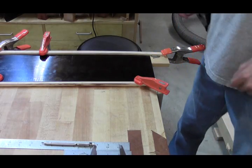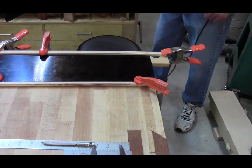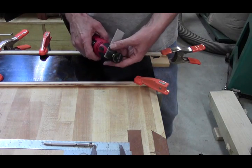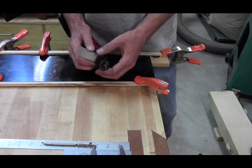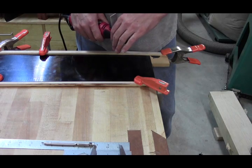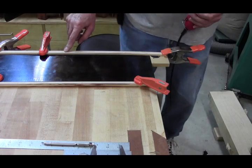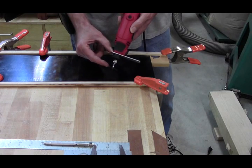I've set up to cut out a blade from my steel. What I'll be using is essentially a generic Dremel tool — I took the collar off of it and slipped a piece of aluminum, just a scrap piece, over that to use as a guide. This worked pretty well the first time I used it so I'm going to stick with it. I don't like to use tin snips to cut this because you put too much stress into it and it's hard to straighten. This way I'll have a nice clean line. I've put down a little strip of plywood as a fence and got it clamped down, so I know the distance from the back of my aluminum guide to the inside of my cutting wheel.